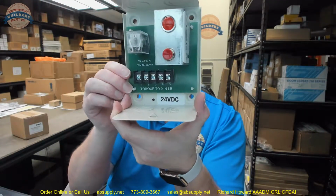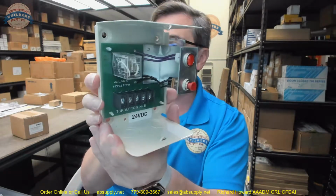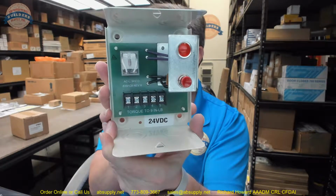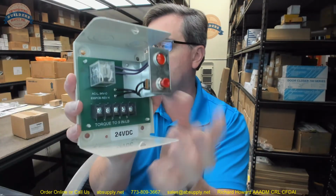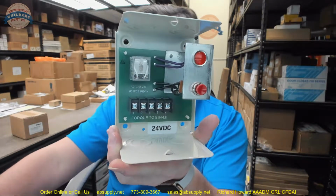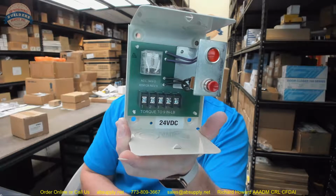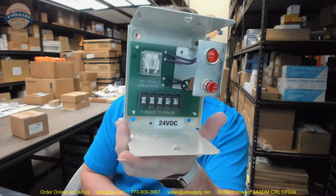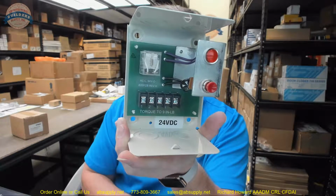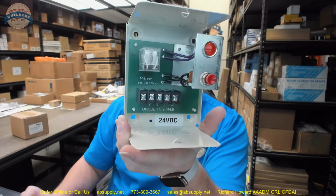The link below this video to the installation instructions shows you its wiring diagram, what you're connecting to the gas valve, the hot, the neutral, and the control switch itself. Note one, control switch must be closed before the reset switch can be pressed. Note two, to test, apply 24 volt to terminals 2 and 5, hot and neutral, then jumper 3 and 4. Remove the jumper and the relay will drop out. All external wiring must conform to local electrical code, naturally.